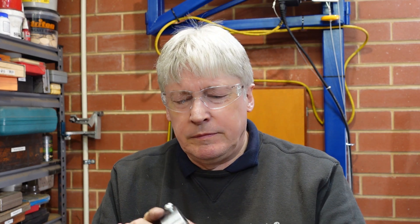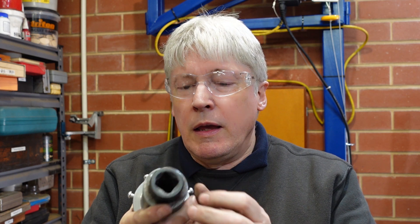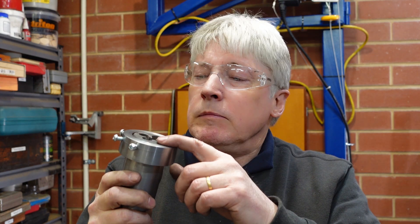G'day - the other day a friend of mine came in with a lump of steel and a die and said 'can you make me one of these?' It's basically a two-inch die stock, and this is a two-inch die holder as well, but this one has a three-quarter inch socket on the back. This particular chap works in an industry where they get things hot-dip galvanized, so the idea is to be able to put a 16-millimeter die in here and just run it down threads that have got a bit of extra zinc buildup.